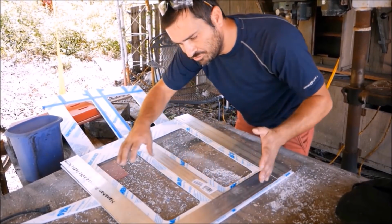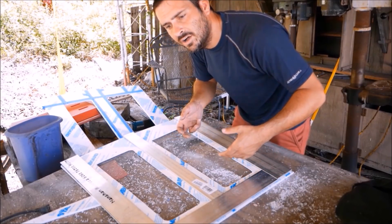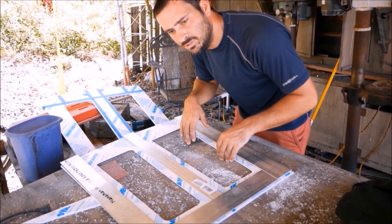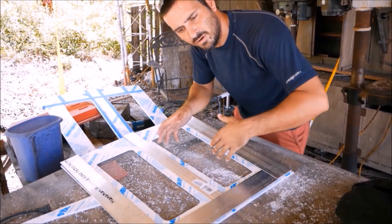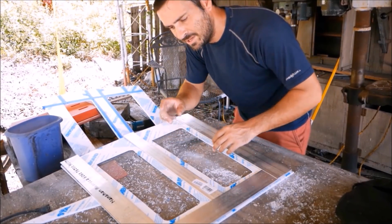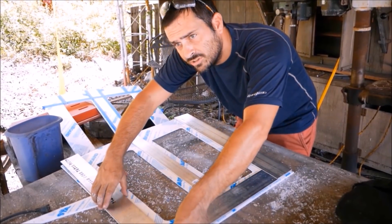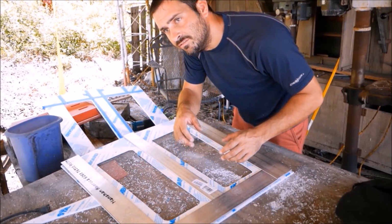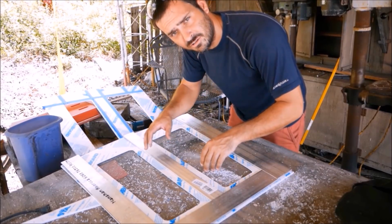So these will be bolted together. Once they're bolted together, there should be enough rigidity in it that's going to act as kind of security. That's going to be just easier for us to climb in and out of the companionway, instead of having to pull those drop boards out every single time we want to climb in, easier to get groceries. But the big thing is, because it's 1/4 inch thick, and we're leaving the top section open, we're able to slide in sections of 3/16 plexiglass or Lexan.